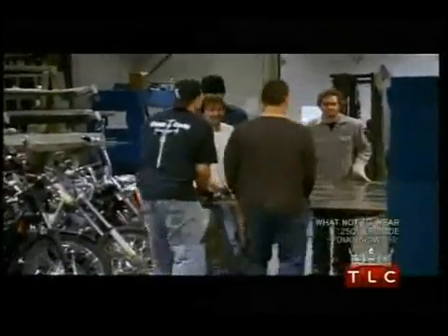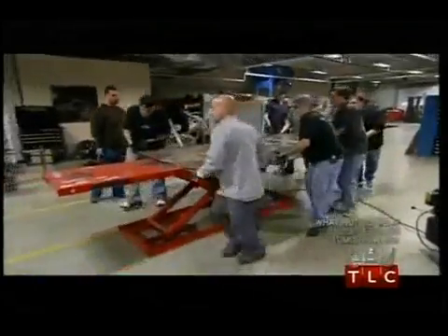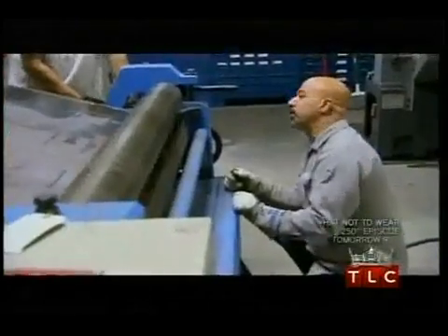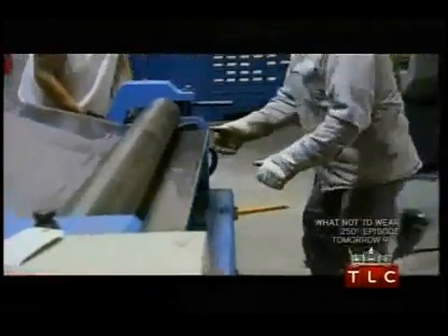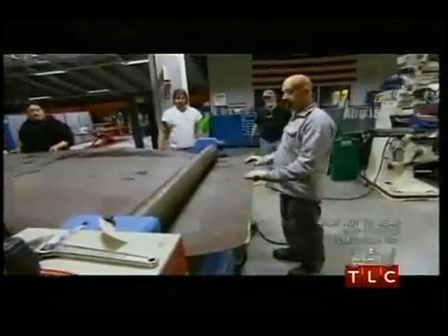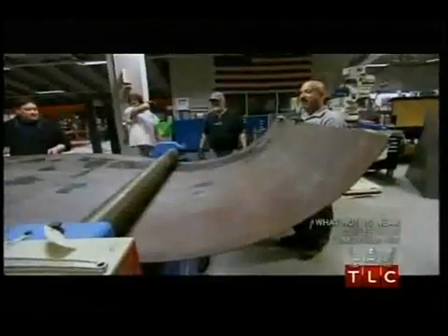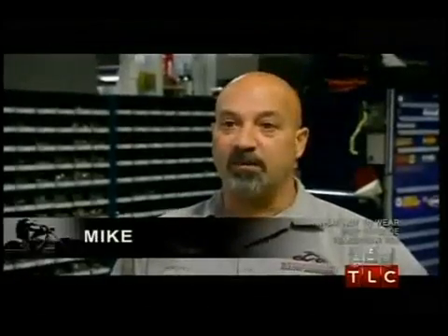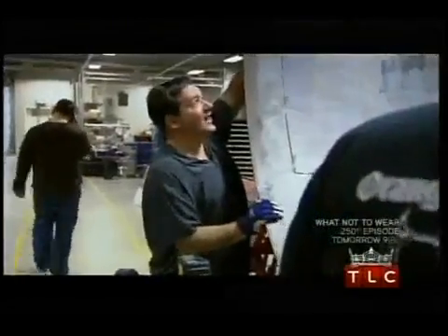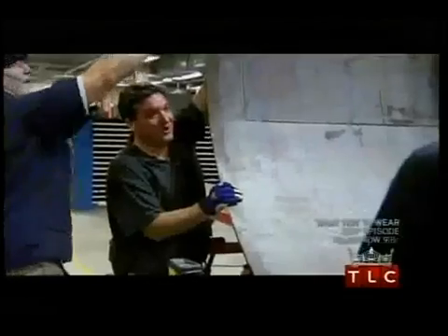The first thing to do is bend that big round tube that's going to be the main cooking chamber of the smoker. It's rolling — remember, we don't like a tight roll anyway. It's a big piece of metal. The roller we have is capable of bending a large piece of plate; we usually just use it for tin and lighter metals, eighth inch being the thickest. So it's the first time we've ever put something substantial through it.